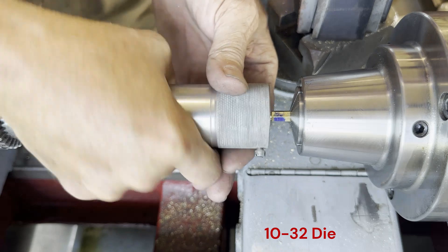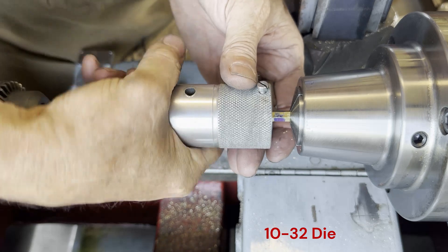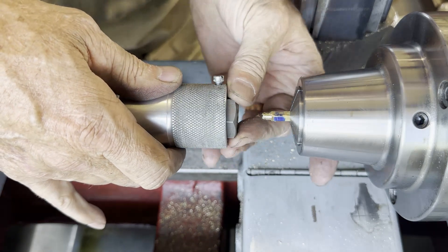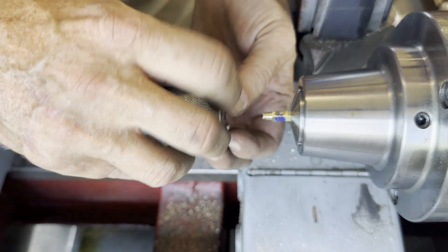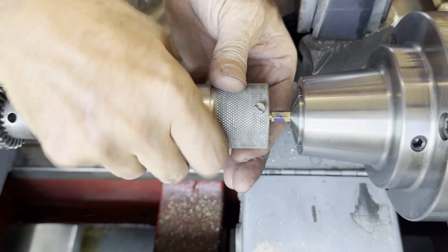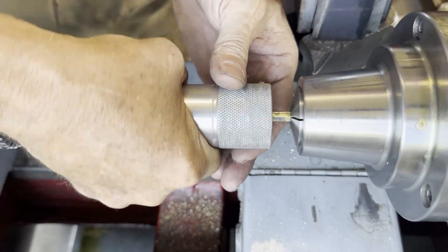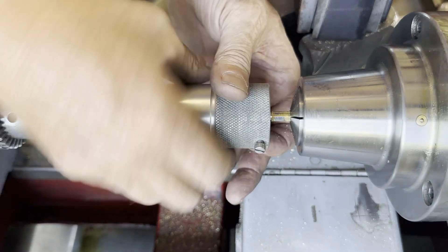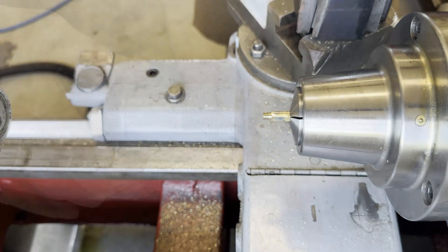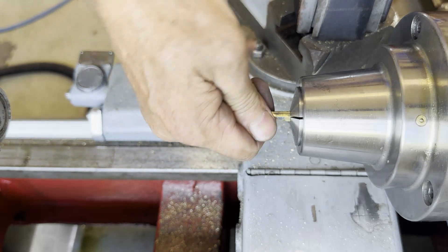This is also a tool I made in the shop that keeps the die lined up. You use your tailstock as support for the end of it, and it runs along a retractable rod. Then I flip my die over so I can get those threads just as close up to the head of my bolt as possible. Of course you can't run the threads all the way to the end, so you're going to have to deal with that shoulder. You can see my headstock rotating a little — that's because I didn't have it in low gear — but it worked okay.